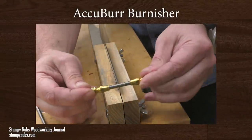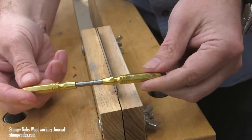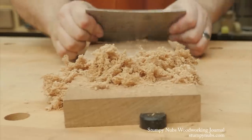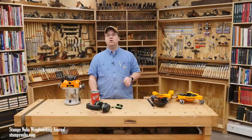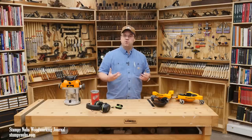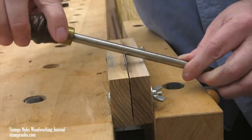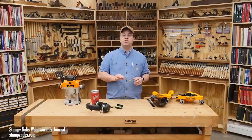This is another one from a recent video that got a lot of attention. It's a burnisher specifically designed for forming the hook on the edge of a card scraper, which can then be used to create silky smooth surfaces on wood without the dust and noise that comes from sanding. For a scraper to work, the steel along the edges must be formed into a pair of hooks — one on each side. It's these hooks that shave the wood, but it's also those hooks that frustrate a lot of woodworkers because it can be difficult to form them with a typical burnisher.